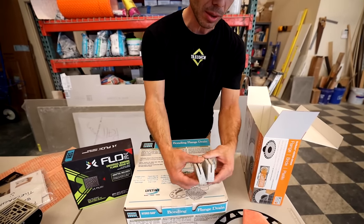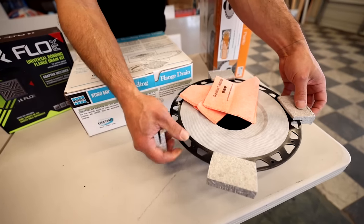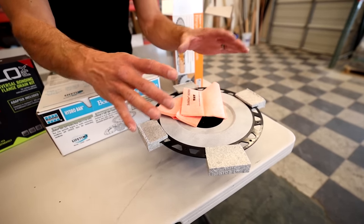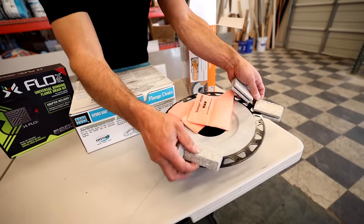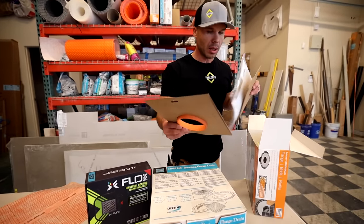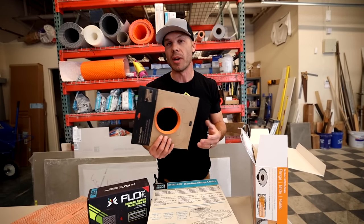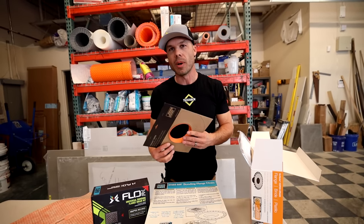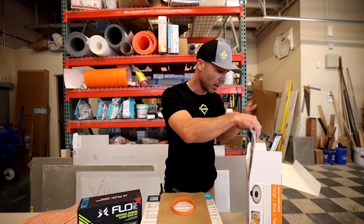So we got spacers — these come to get the correct spacing if you want to set your drain body into the subfloor. That way, when the plumber pushes this down and the spacers hit the subfloor, the pre-formed foam pan liner will slip in underneath at the right height. It also comes with pipe seals. The pipe seal is decent, but the valve seal really only works on a few different valve manufacturers. Most of the time with the valves we use, it doesn't work, so this is kind of a waste.